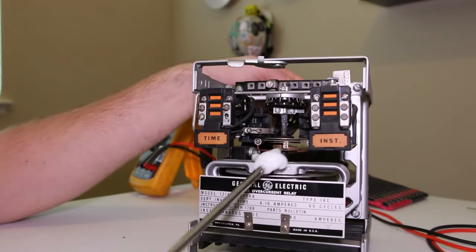I'll connect my test set on the black terminals, which go to the top of the test paddle and to the relay when it's in service. The bottom red terminals are on the bottom nuts. Some relays are taller and will have a separate service panel on top and bottom if they need more than 10 connections. Make sure on terminals 1 through 10 the numbers are right-side up. On a double-height case, terminals 11 through 20 work upside down - on the top slot red is on top, on the bottom slot red is on the bottom. I picked this test paddle up on eBay.